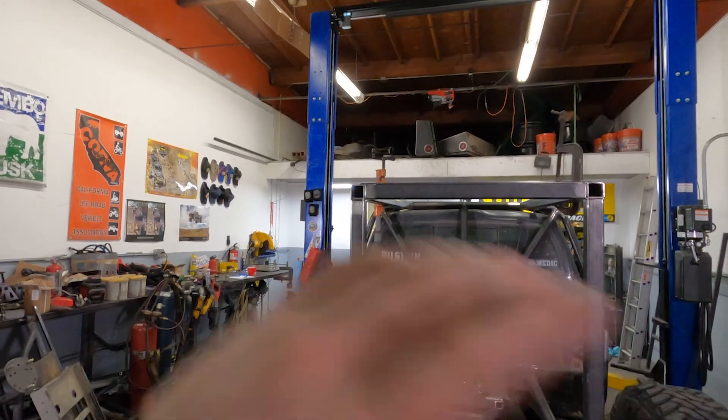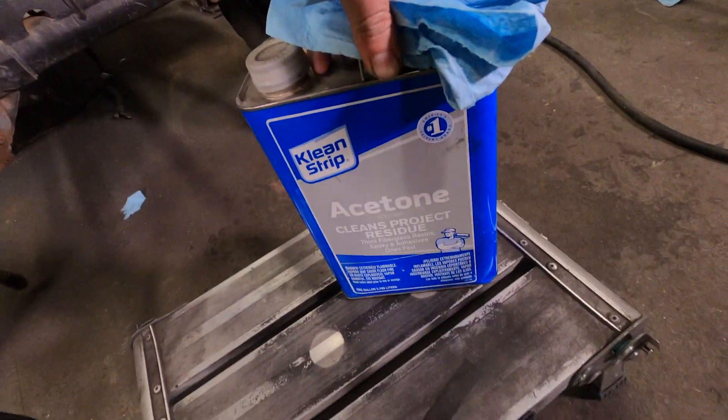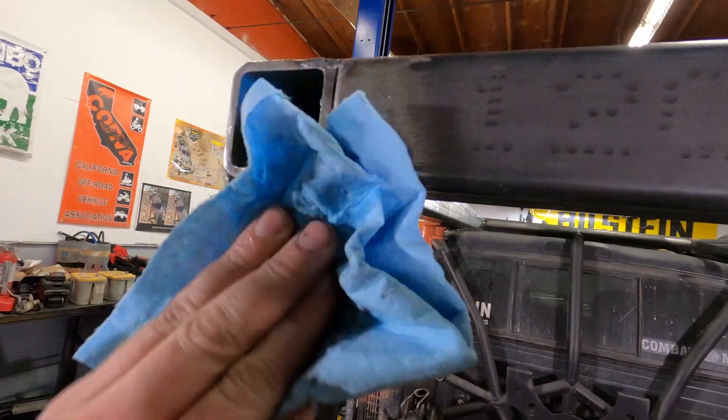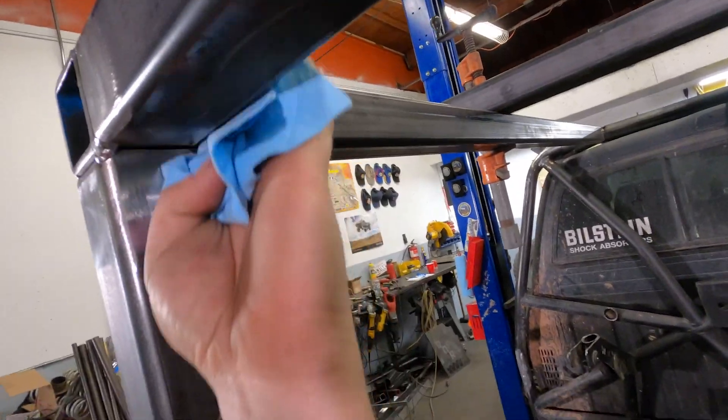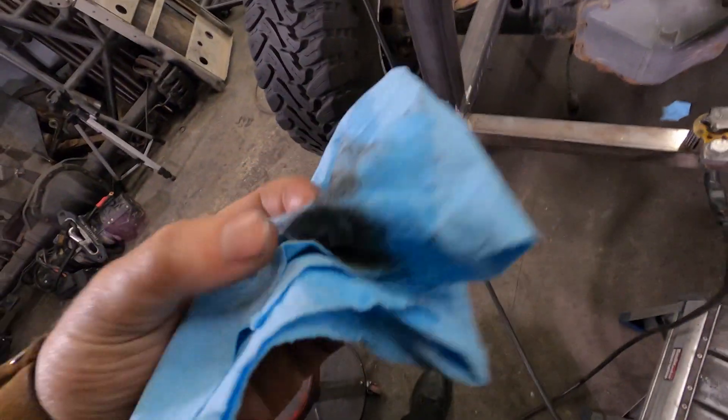There are also guys who aren't good welders but want it to look a certain way, so they'll do a bunch of tack welds — you end up with all these little fish eyes, and it's a really cold joint. You're not properly fusing the material together. If you build a roll cage like that and go to tech inspection, they'll take one look and tell you to get out — it could kill somebody if your joints aren't fused properly. I take roll cages really seriously; this storage rack, I'm not taking seriously at all. Good prep work is honestly maybe the most important step in welding. After wire wheeling, wipe everything down with acetone — do you see all the stuff that comes off? That was still going to get into your weld and mess it up.